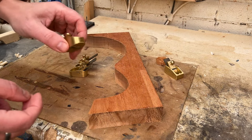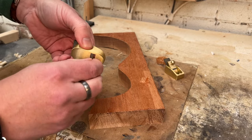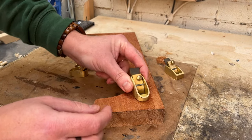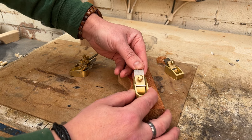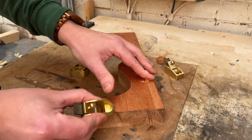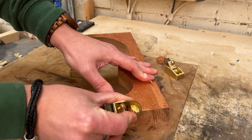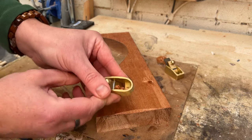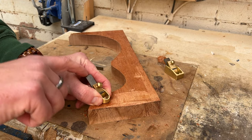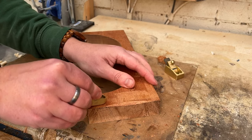What about the big one? Yeah, not so much - but again, some of this will be blade depth. It definitely wanted to cut but I think it was cutting too thick. All of these have a thumb screw, so I'm going to lay that on there and just tighten that up to the correct depth. Does it work off the edges? Yeah, I can do that with it. Tricky to hold because they're so small, but that's definitely cut. All I'm doing is pushing it flat onto the wood and tapping in before tightening up, and at the correct tilt it will actually start to take some off.